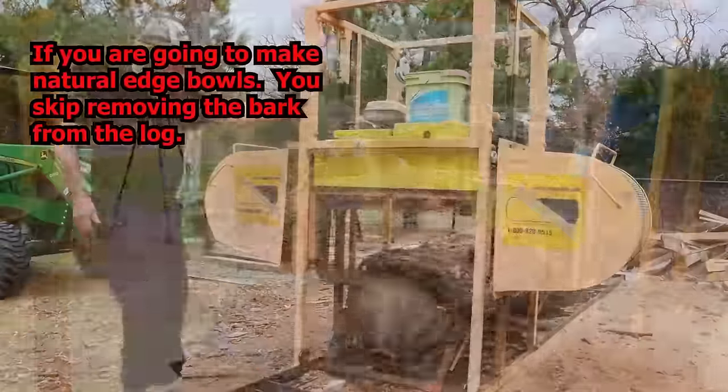Yeah, small limb knots there, but they're not showing up on top. So I think that will be all right for the bowl blank. They're not coming through. There seem to be shallow pin knots on the outside of the bark. So we're good right here. We've marked out all the problems on the thing, and so that's taken care of the bottom. So give him a minute to readjust and then we'll start laying out the top.